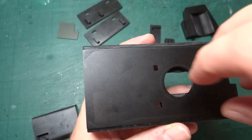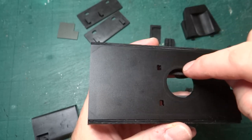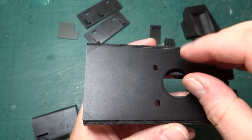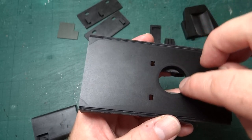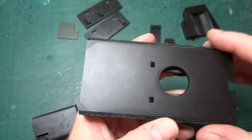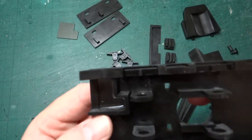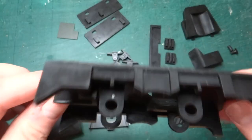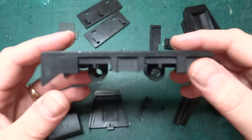It's meant to be a tight fit, so the motor is tightly held, but because of the way the first few layers expand a little as they're printed, this hole is deliberately undersized. So you need to scrape around the edge to open it up enough to get the motor to fit nicely. At this point I usually fit the motor, check it meshes nicely with the gear, but then remove it, because it's going to help with painting in a minute.